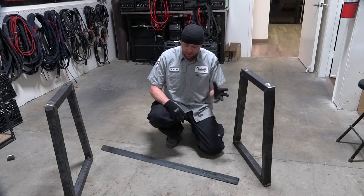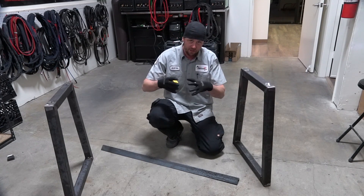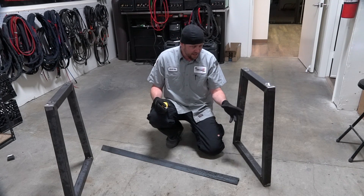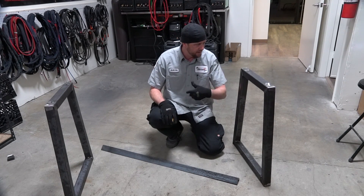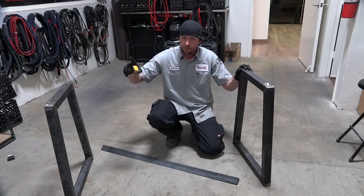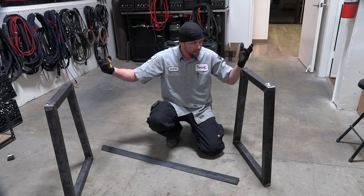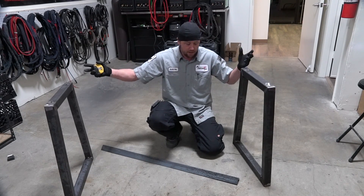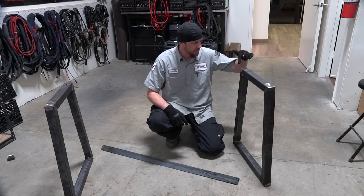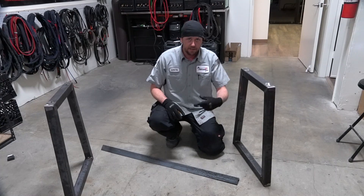A lot of welding, a lot of grinding, just dressing it up. I don't need it to look pretty — it's just a sheet metal bender stand. But we've got to get some support in here, top and bottom, and that's going to square it all off. If the sheet metal brake feels too wonky, we'll add some triangulation. Ideally I want to add a tray in the bottom of it later. The most important thing to remember here are the bolt holes. We measured from center of bolt hole to center of bolt hole on the brake, then subtracted half the width on each side. This is two-inch wide metal, holes centered right down the middle. So we take the width — which was 50 and a quarter — subtract two inches, and that brings us to 48 and a quarter, which is the width of our angle track to stabilize the piece. Now we just need to line them up to center, tack them in, double-check measurements, fully weld it, and then we can mount our brake.